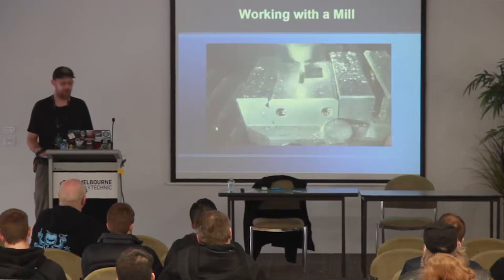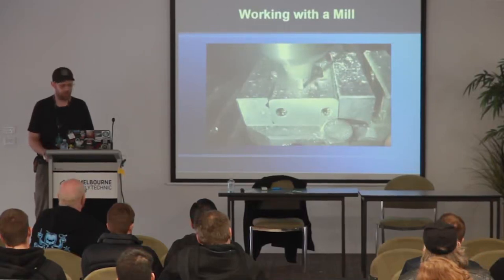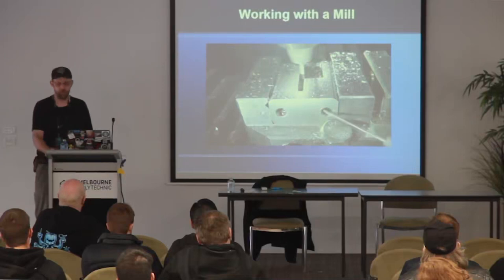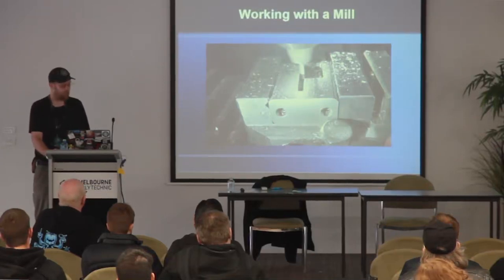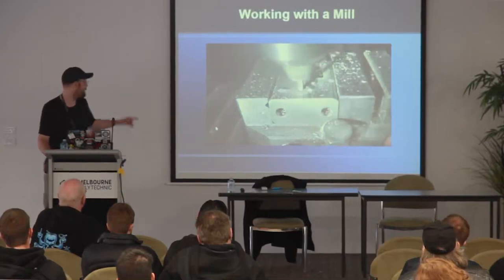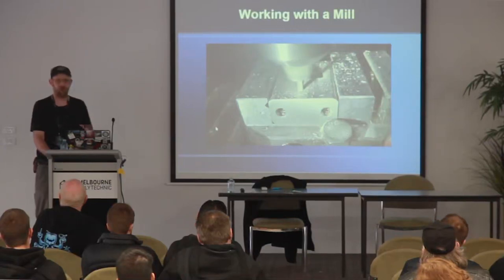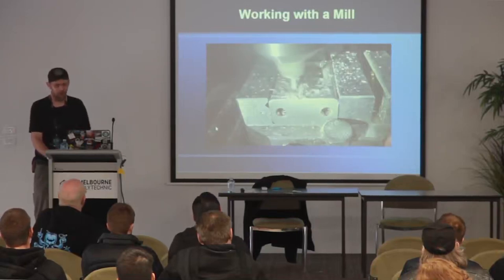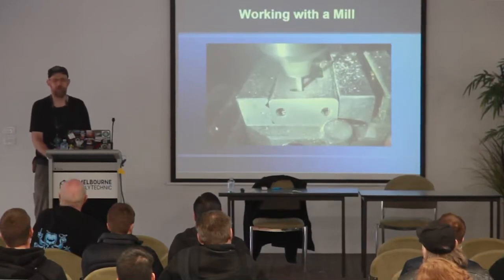Because of how sharp they are, I don't have to worry about material. I can mill brass, stainless steel, aluminum — all with the same tool. So it minimizes my tooling and my setup time. The only tricky part with this lock is when you cut across, if you cut too far off the center of where the ball bearings are, sometimes they'll fall out or they'll jam in the lock and then you have to start all over again. On average, I'd probably destroy about one in every 30 to 50 locks that I cut.